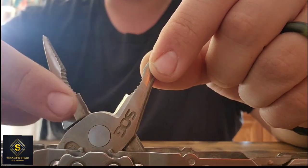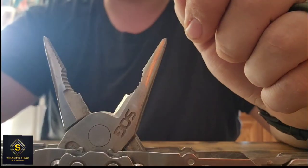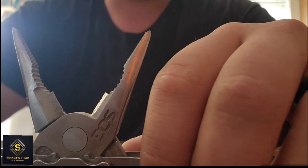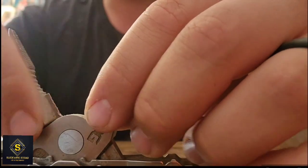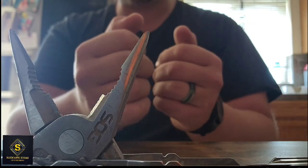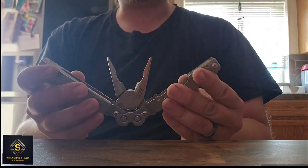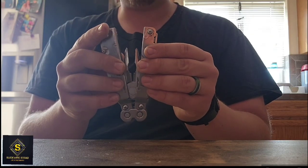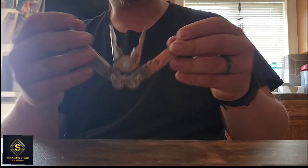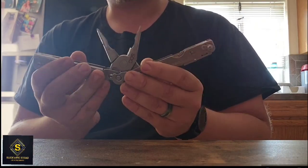These cutters can cut a lot of stuff — you can cut keys in half, I have cut box springs with them. But the moment you use these on any hardened steel, they will deform. When they deform, they push out, or in, or curl around. When you have that situation and you close the knife, it will begin to bind up and you have to push it closed. After a few times you can kind of walk that in and get it going again, or you can resharpen these — they are not removable.